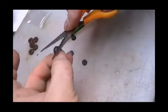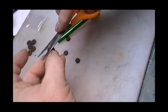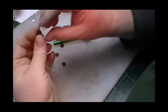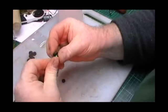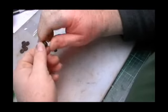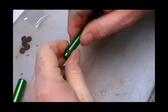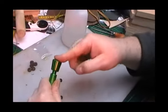Trim like that and at the bottom as well. The pieces of leather have been specially chosen so that they do allow for easy molding. The leather is soft and much more pliable than some leathers. So now that you've done that you can just squish it down and you can see it flattens out quite nicely. When we put the piston on we'll see that it's all nice in shape.